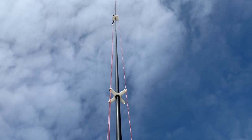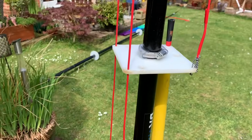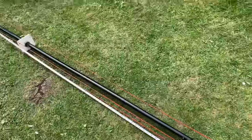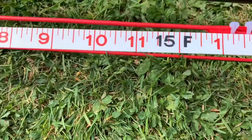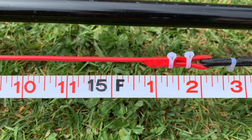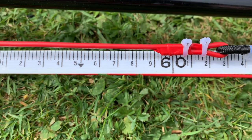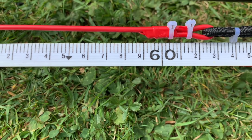To 42 centimeters below the top spreader. We'll take it down and get some more accurate measurements of the actual lengths of the driven elements. The 20 meter element is 15 feet, 2 and a quarter inches, with a 1 inch fold-back, and for those of us in metric, that is 4 meters 60, with a 3 centimeter fold-back.